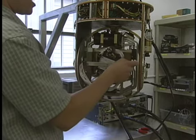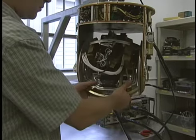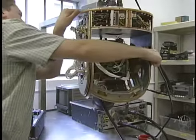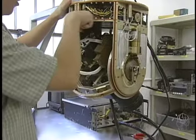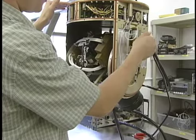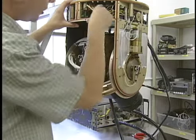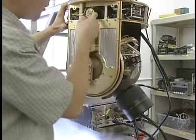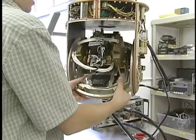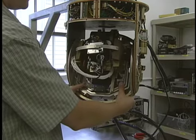There's also a motor up in here for the side motor — it works the same way, plus and minus six volts. When the camera sits stabilized, it sits in a zero position. Anytime there's a swing in any direction, it puts out voltages in plus and minus directional degrees. The main processor drives these motor driver boards right here, which control your roll, your inner and outer azimuth, your outer elevation — located all the way up in here with a big rotary motor underneath. Anytime the center ring falls out of position, it drives the motor circuitry board to put it back into a zero state position.